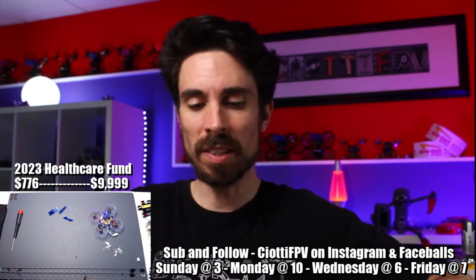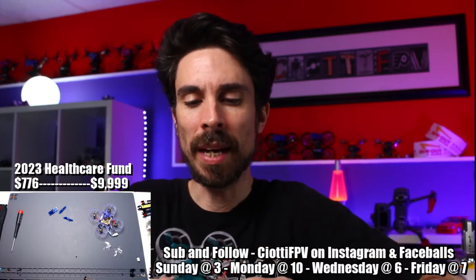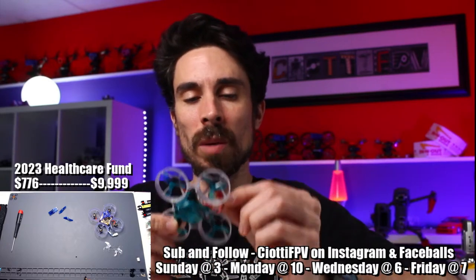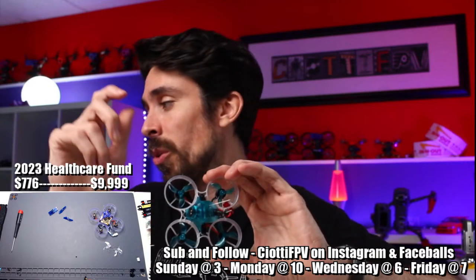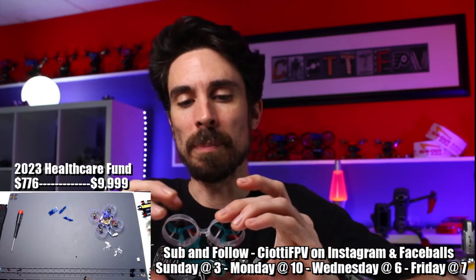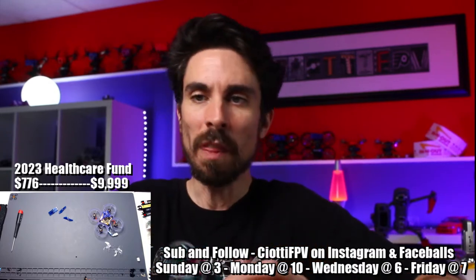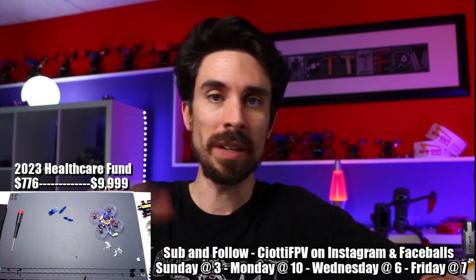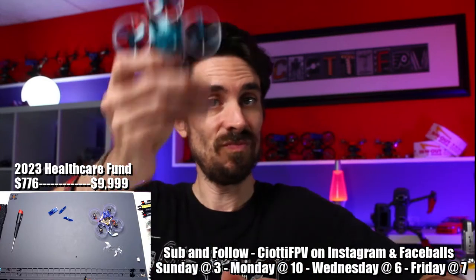But let's screw around with it for science and see if we can squeeze a little bit more performance out of it. And then the last thing that I'm going to do is really lay into it with some upgrades. We'll go to BT 2.0. We will swap over from these Hummingbird 0802 25,000 KV motors to the Newbie Drone 0702 29,000 KV motors. And hopefully that will actually get some performance out of it. But the super simple, super cheap ways of getting extra performance out of quads are tuning and propellers. I don't think that's going to do much here, but let's find out together.